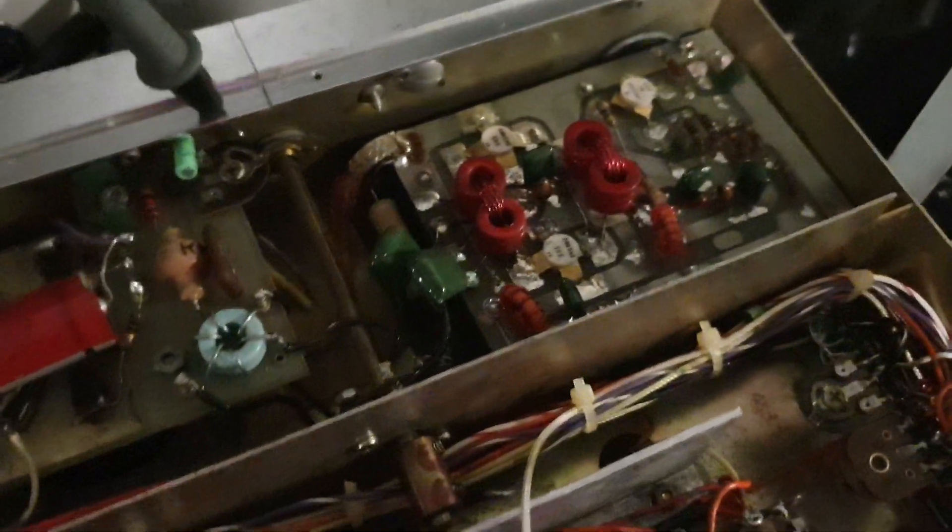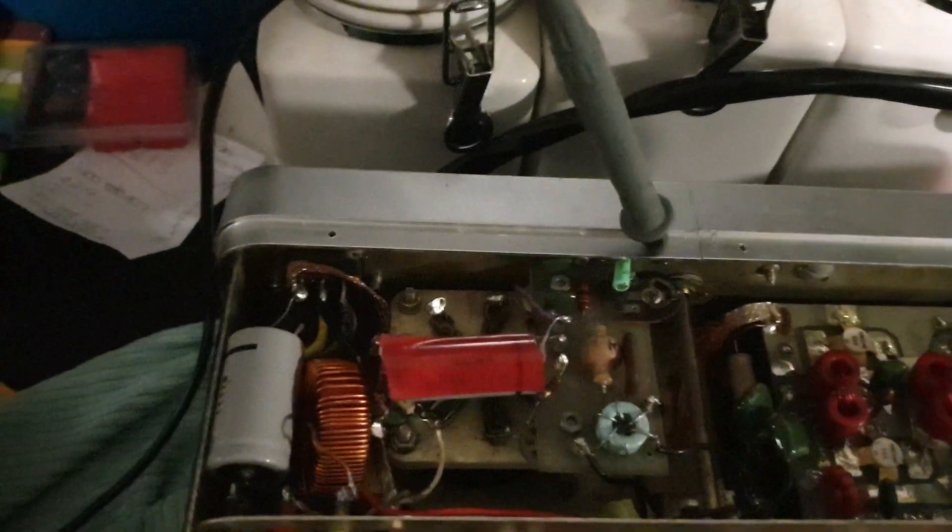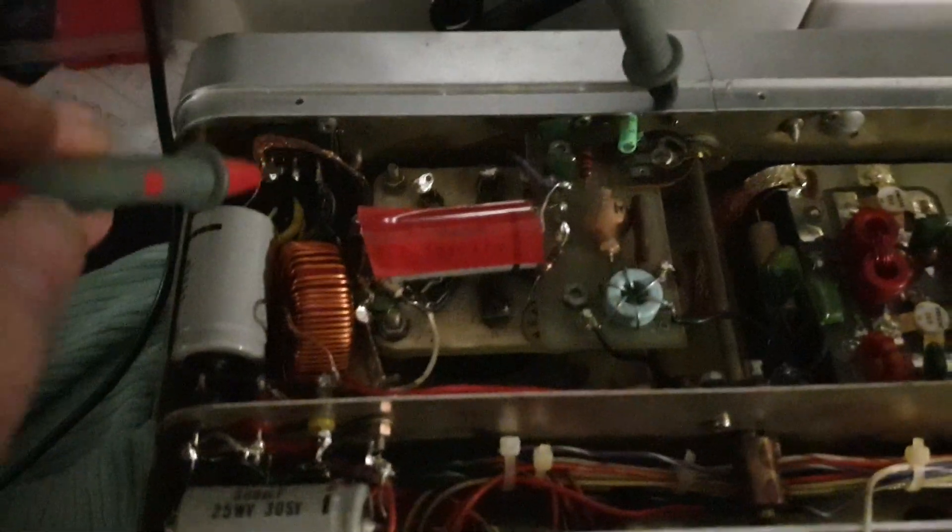The good thing is that before I get to the valve stage I can sniff out RF all in this area. I can sit there and make sure at a 12-volt level it's got some RF being sniffed off it. Actually, just to prove it — wrong probe. Let me grab the positive probe. I reckon we found about 12 volts coming off right there, and look at that — there's our 12 volts to power the driver stage.